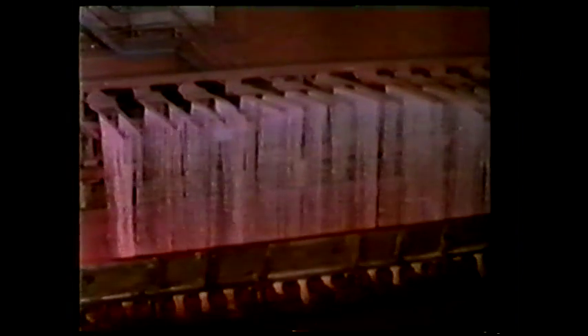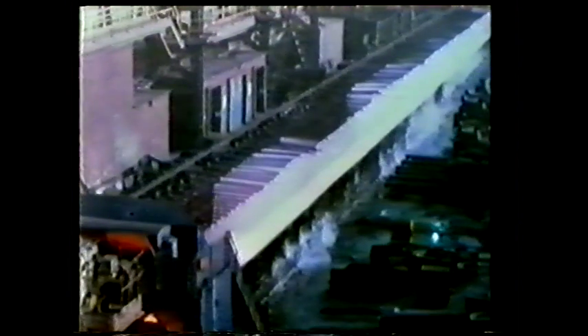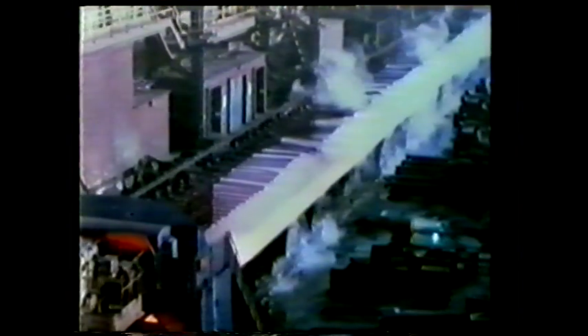From the finishing stands, the strip emerges at a roaring 40 miles an hour down a long run-out table over which multiple water jets are playing. The temperature of the strip has to be nearly halved from its 1,100 degrees centigrade before it can be coiled. In its lighter gauges, the strip steel would present insuperable handling problems unless it could be coiled as continuously as it arrives.